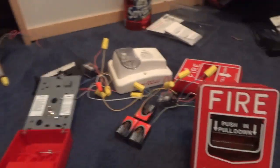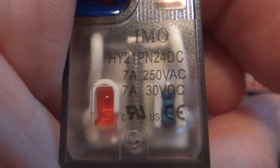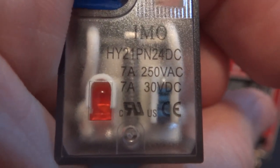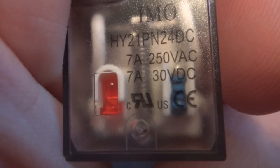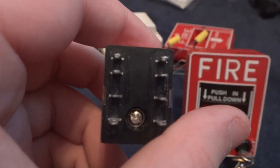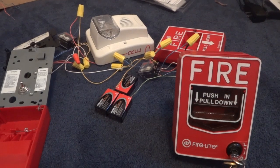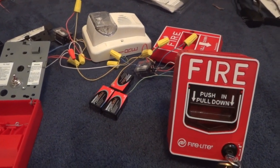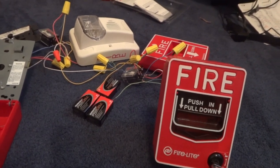What I did to get this to work is I built two latching circuits out of relays. This is the stuff on the relay — you can see there's the alarm LED, a resistor in there, and these eight terminals. It's actually really easy to build a latching circuit when you know what you're doing and when you're using the correct relays.